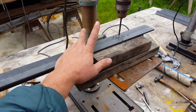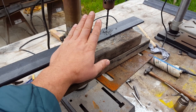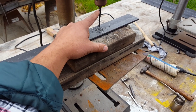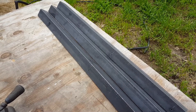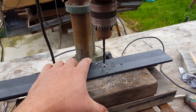While the paint is drying on the wood pieces inside, I've started drilling holes in my four legs. I'm using 3/8 hardware, so I'm drilling 3/8 holes using this drill press. If you guys don't have a drill press you can always drill by hand — it just takes a little longer.